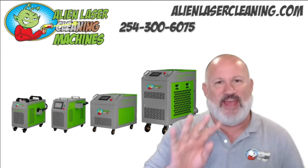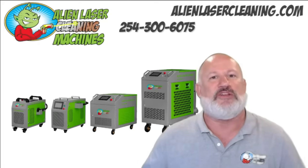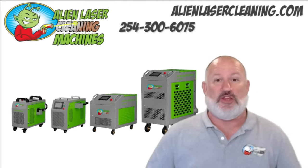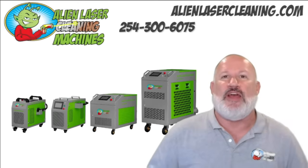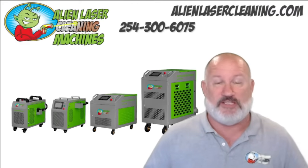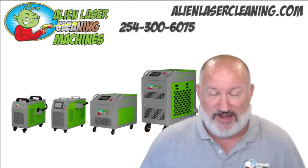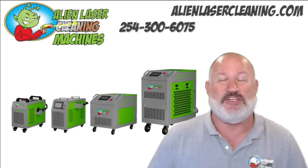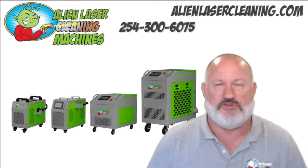Every case can hold different style of equipment. We have what's called a pulse machine, which is basically the white glove approach to laser ablation, cleaning, and restoration. Then we have what's called a continuous wave laser — it is for the commercial and industrial type projects, the get-it-done style machine. The continuous wave machine is more aggressive and a little bit rougher on the substrate, though it doesn't harm the substrate.